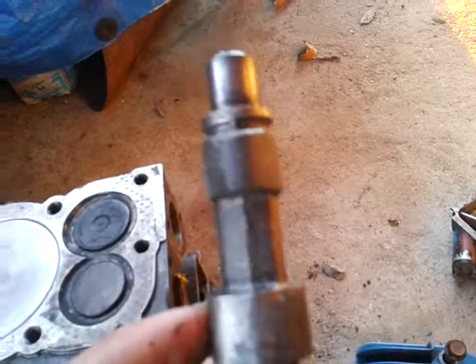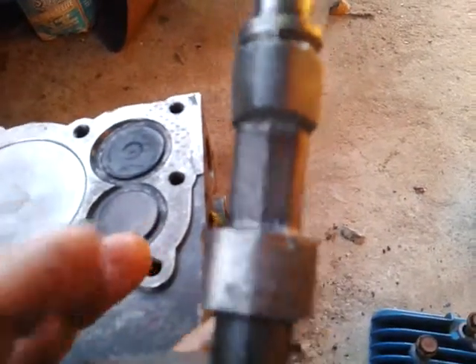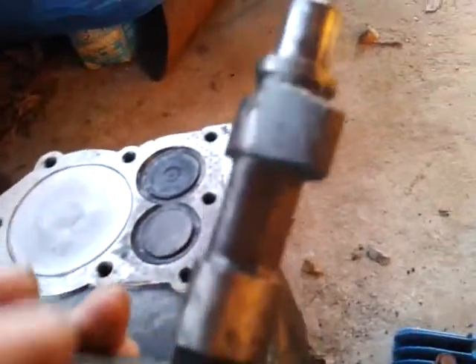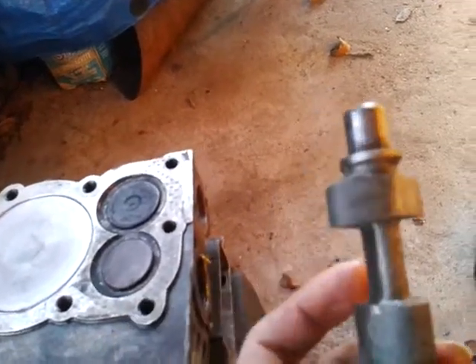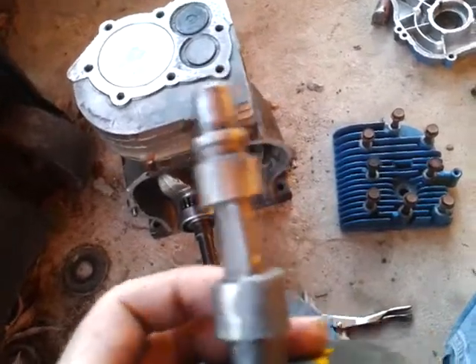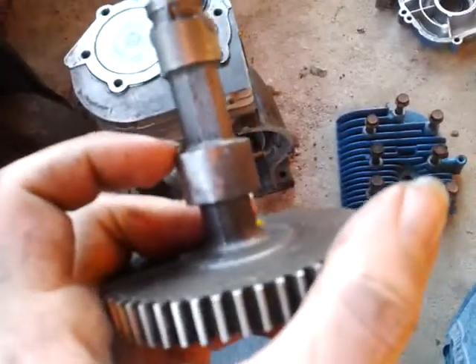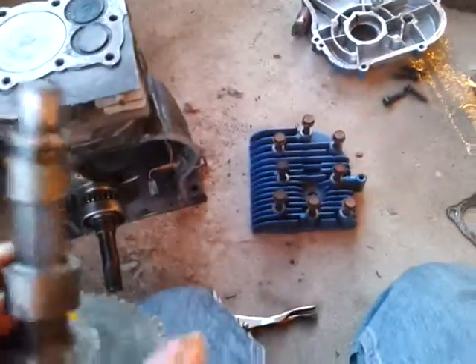So this is pretty simple — just make double lobes on both. These two lobes are a little smaller because I made the engine a little bit more efficient by letting the valve open a little less longer. Now you can see both cams are lobed. Right here I left this cam alone — this was for the first version that I showed. This cam is not going to be used at all pretty much; it's just this one as the exhaust, because the intake is just coming in through the spark plug hole.